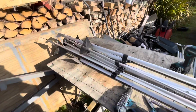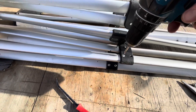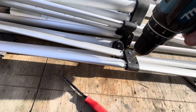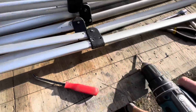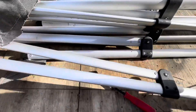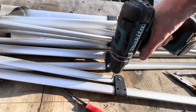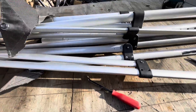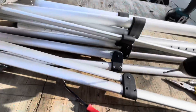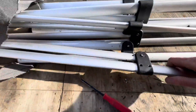That takes each arm off. There's another one on the bottom that's to be done. There are a few little bits and then just rivets basically. Taking them away like that makes it a lot easier. This bit is a roofing iron drill bit. They're quite pricey but they're incredibly good in terms of length of life and what they can drill. They're basically just designed to drill through a bunch of sheets of steel, so I'm not going to have too much trouble getting through this.